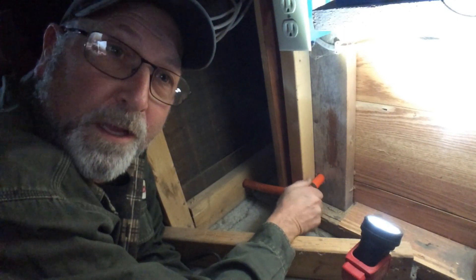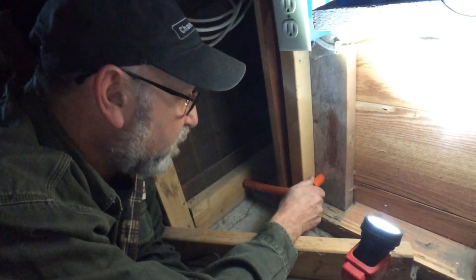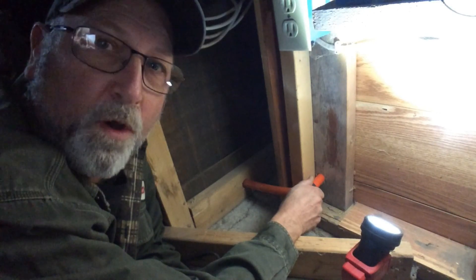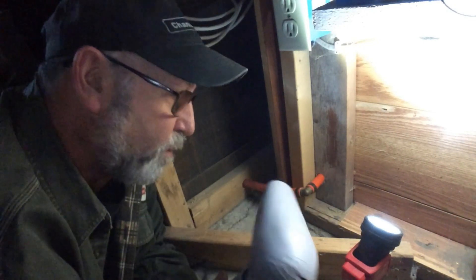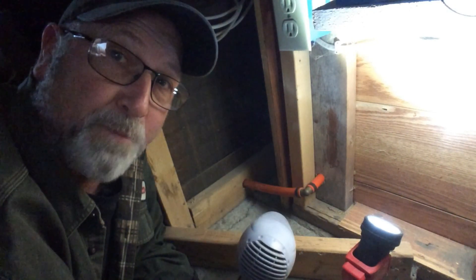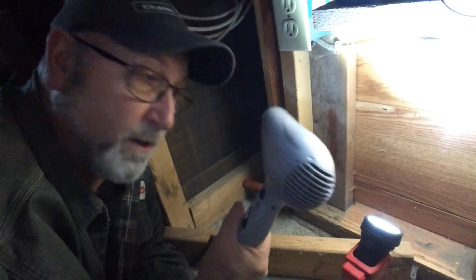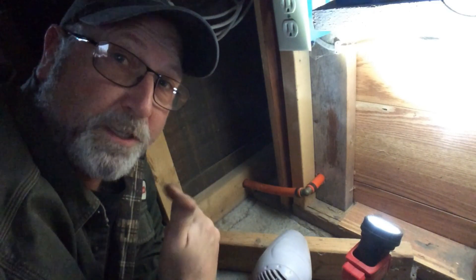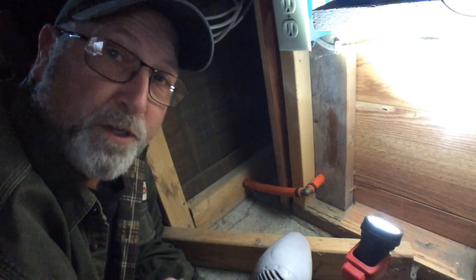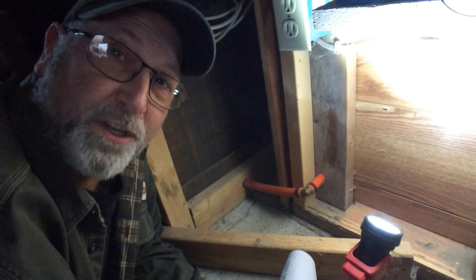Well, there it is. I don't know what's going on on the third floor, but the basement is all set. I don't see any water or hear any water — we're all set. That's how you thaw frozen pipes using a hairdryer. Don't ever use a torch. This is the best way to do it. If you can get a bunch of people together, you're going to be that much better, quicker, and more efficient. A hairdryer and an extension cord — just go around from room to room. And if you're lucky enough to have someone going around clearing all the spaces out, you can really get in there and get the job done. Thanks for watching, and we'll see you on the next one.